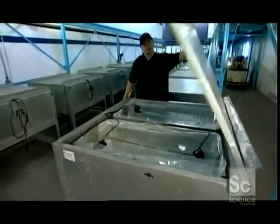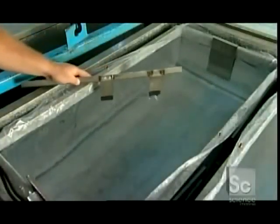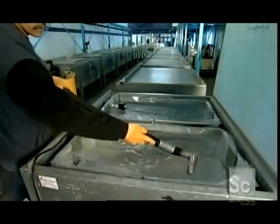He shuts the lid to allow the water to freeze. 24 hours into it, he'll remove one of the pumps. Three days later, he probes the ice under the watery surface with a pick. It needs to be level, so he checks the entire ice surface with a measuring bar. Then he siphons off the excess water with a wet vacuum — a couple of buckets full.